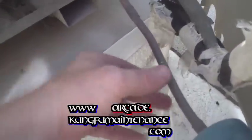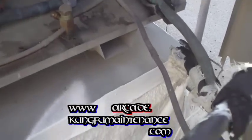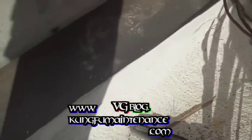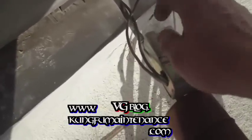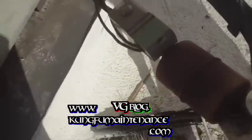They've got another safety device. This one's been taken out on the high side. That's got a little piston in it as a protective shutoff. See if one of the other units has it. I'll show it to you here. This one, no. Bring you over here since this takes a little time. Wow, all these are gone. It's like they took them out on this whole roof. Maybe I'm not going to get to show you. There is one. See right here, this deal. I'm not sure what you call this exactly. Maybe somebody else can tell me. And exactly how it works, I'm not sure either. I think it just has a piston that cuts off the flow if there's something wrong in the system. It's something for me to learn a little bit more about. There's always more.